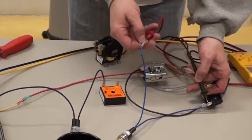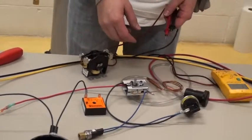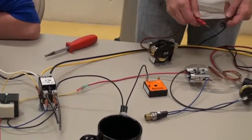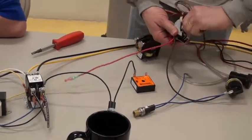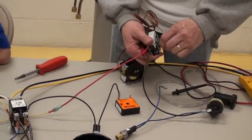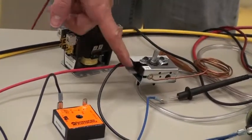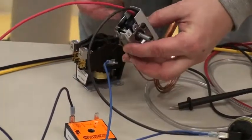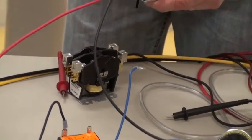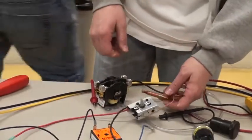That one's open because there's not enough pressure to activate it. This one should be off — actually they should all... we can get this one over here. Do you hear the click? Yeah. You'll be able to hear that on the unit. And if this thing is damaged — I've had ones where this plastic case here will crack — it doesn't matter if you turn it all the way up or down, you don't hear that click. So it's not activating the switch, and that's the way you'll know. If you can't hear the click, then it's not going to go.